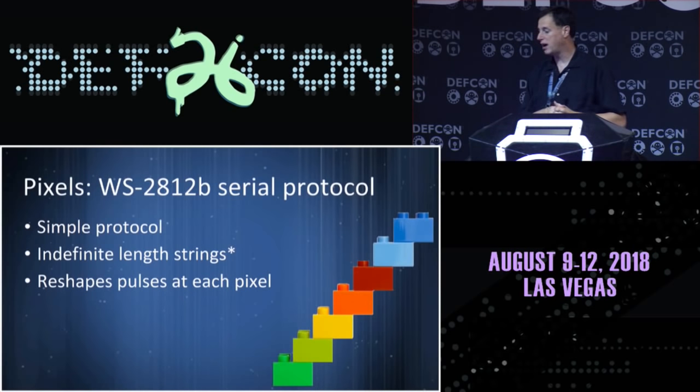It's first in, first out — it strips the first one off the head and moves them down the line. For my display, every 50 milliseconds there's a new color going into every pixel, so there are huge amounts of data moving through the network and out to these strings. As tinkerers and hobbyists, you don't have to understand this protocol deeply. There are smart folks who have already built the controller cards and make them available in finished form or kit forms that you can play with.